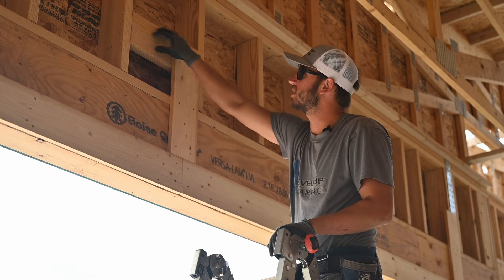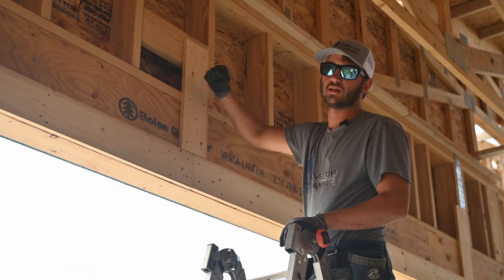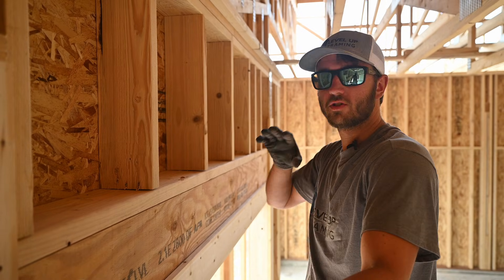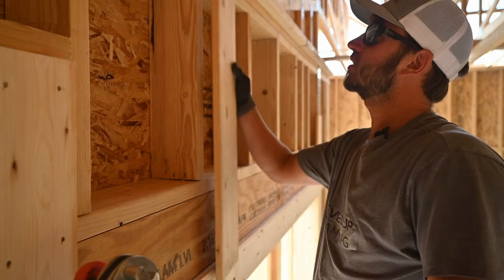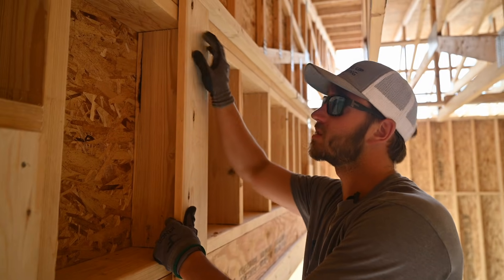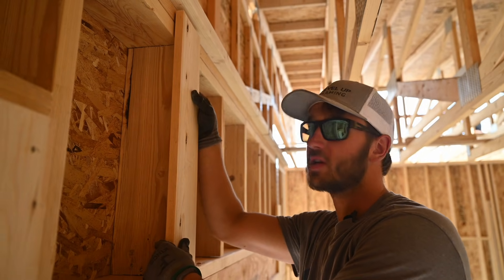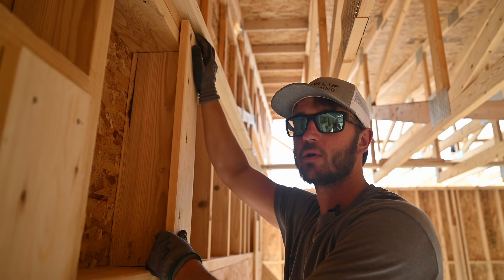I added a block here and this makes it easier for them to drywall around this and it makes this stronger for the garage door guys to screw to. We only ran these boards two feet up, but if you are running them all the way to the ceiling, instead of butting them into this backer here, leave them down five eighths of an inch — and try and make that pretty exact because then the drywallers will just slide their drywall right in there.